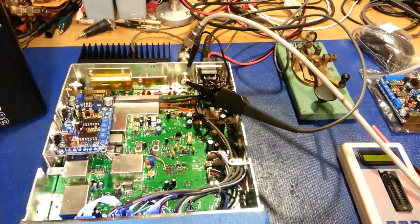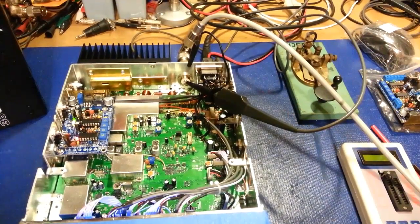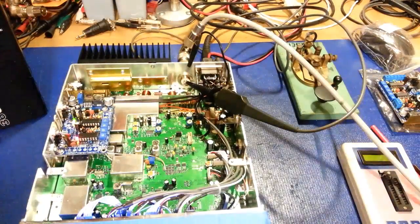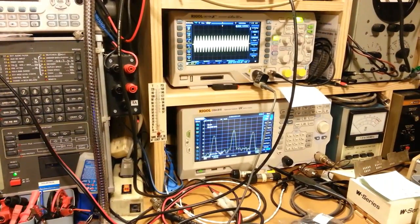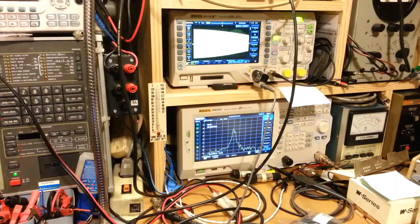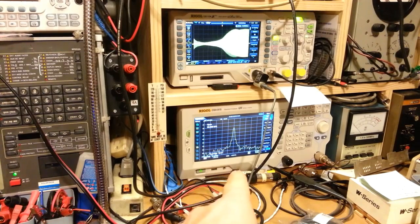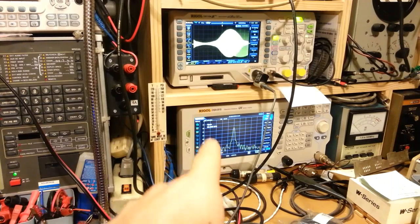I'll turn my walkie-talkie on here. Key the radio. So that's just the carrier. Now I'm going to turn on the output from the signal generator. So you can watch as it's doing it. So you can see all of that extra crap that's getting out there. It gets to a point where it's useless. Why is it broadbanded that far? You can't hear it. You get to right about there. You've reached the limit of human hearing. Yet it's still transmitting, and I could go out even farther.